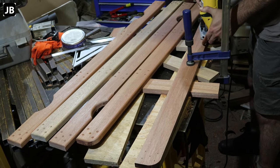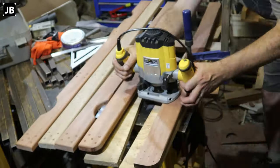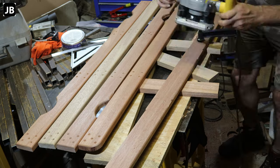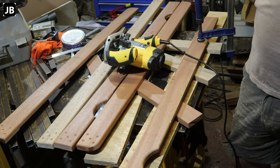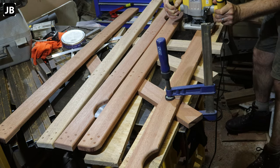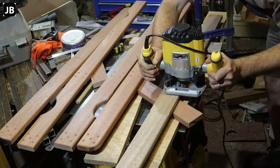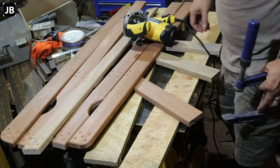Here on the underside of the board, you'll see me stopping short on all the joints. This took a bit of time — I mashed up one of them, but not that bad. It's mine; if I'd built it for someone else I'd probably remake that board. Always look out and make sure you concentrate. Just clamping down the boards making sure they don't run off the edge of the table. You can see me stopping the cut short — that's where the cross pieces will come in. This took a fair bit of time compared to just running straight lines.